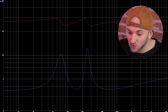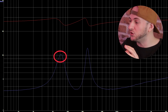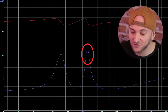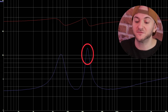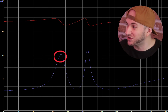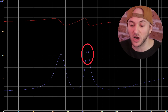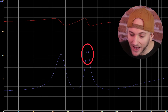Also, this graph tells us that the box is much smaller because, firstly, the initial impedance spike down here at 72 hertz — where the box starts to unload, the port stops working, and the front and rear waves of the woofer meet each other and cancel out — is actually lower than the upper impedance peak here at 255 hertz, where the air spring starts working in phase with the cone's movement. So the fact this first peak is lower means that even when the woofer's unloading, the box is still small enough that there's a bit of pressure going on inside to limit the excursion.